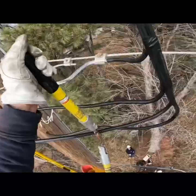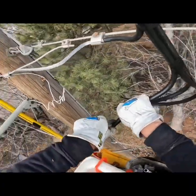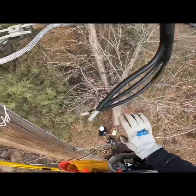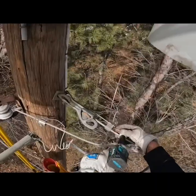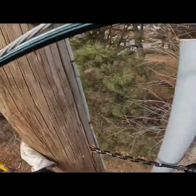The first thing I'm gonna do is shape these legs out of the transformer bank, get them cut to where I like them, and then I'll bond that neutral to the system neutral. Then I'll take the grounds off of the transformer bank, brush the wire, and take the grounds and bond it to the neutral. It's also bonded to the pole ground as well, but I didn't get that part of the video in here.